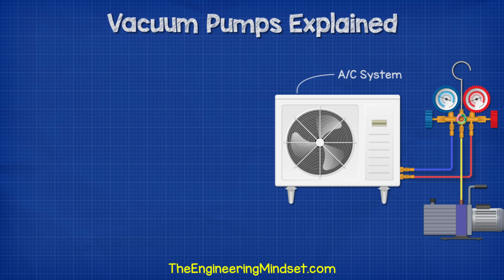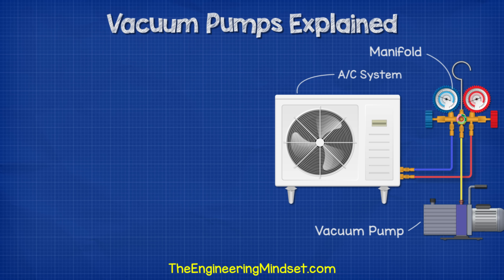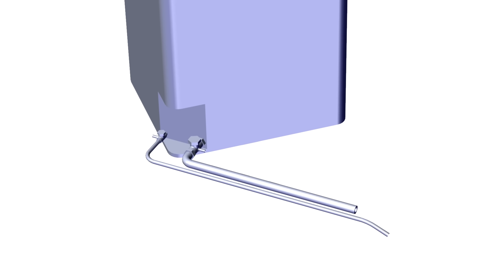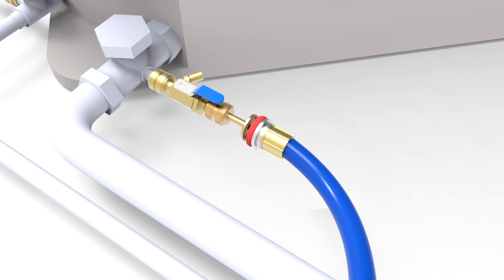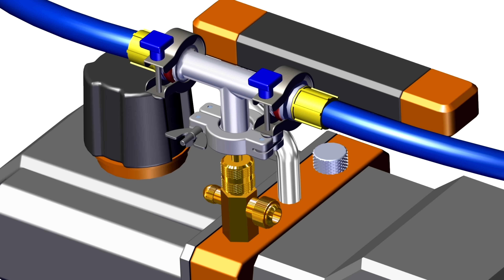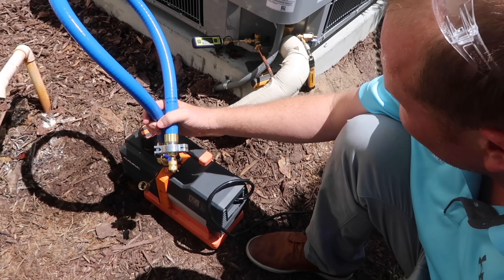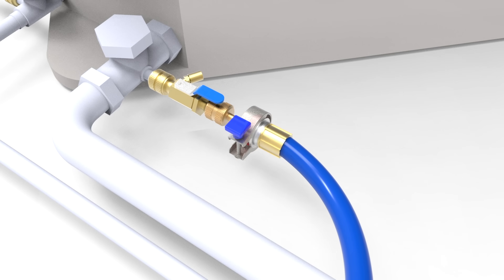On a typical air conditioning system, you'll see the vacuum pump is connected via a manifold across the high and low pressure side of the system. A better way to do this is to remove the manifold completely and connect the vacuum pump to the suction line with a pressure gauge connected to the liquid line. We connect the pressure gauge here because it's the furthest point in the system so you get a true reading. I've teamed up with my friend Brian over at HVAC School for this video and he's going to run you through how to actually connect a vacuum pump to a real world system — links down below.